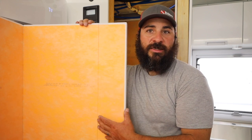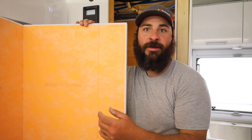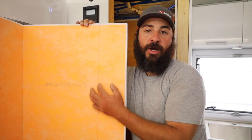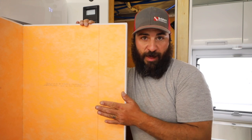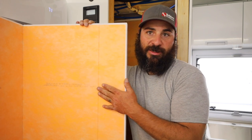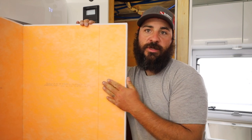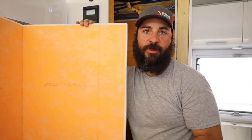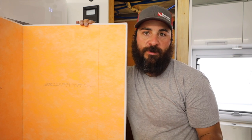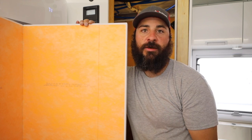Sometimes I actually leave this flat section so there's a place for the mud to go — I don't like buildup of mud. Sometimes I'll leave a couple inches to get that initial mud adhesion going between the drain flange and the shower pan, and it gives a place for that mud to sit. There's actually about an eighth inch of depth right at that line. We're going to get this thing cut to size, get the drain mocked up in place. You always mock everything up before you thinset anything down, dry fit of course, and then we'll go from there.